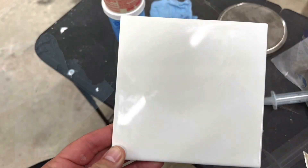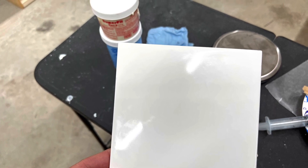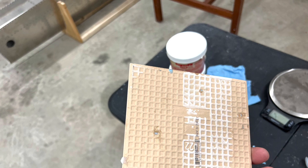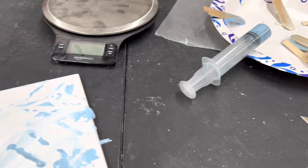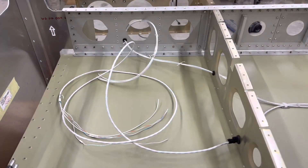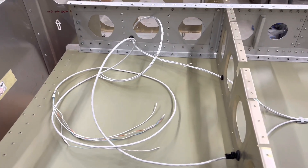I've got an Amazon scale and I do it by weight, then I put it in a syringe. A little tip from the RV builder crowd: use a six-by-six glossy bathroom tile — I got it at Lowe's for 35 cents. I just mix the epoxy on top of it; it gives you a good solid base for stirring. When you're done, just razor blade it off, put a couple drops of acetone, wipe it clean, and you can use it again and again.